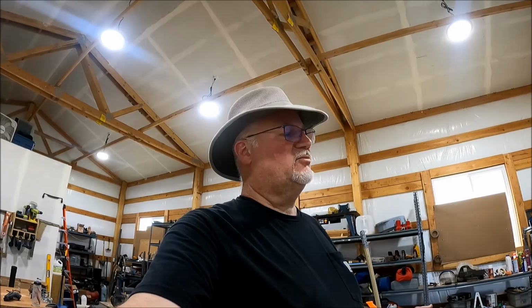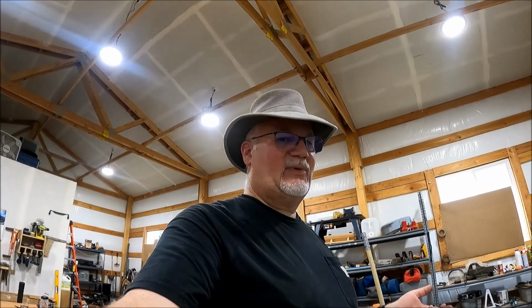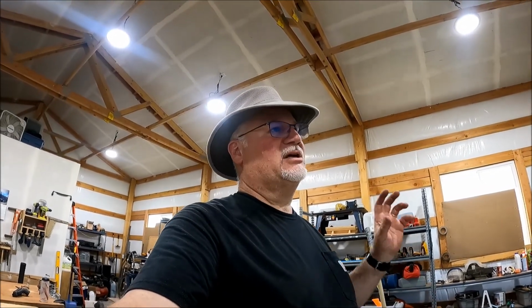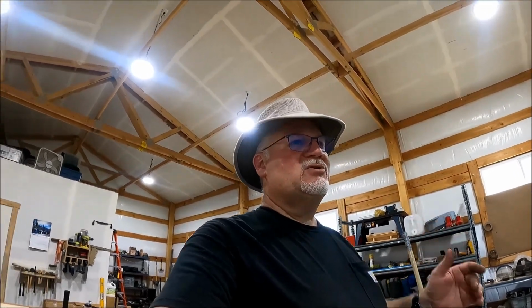I like to get set up the night before. Then you get rolling, you roll all day long, cleaning the mill as you go. I like to use the air to blow everything out and keep it running clean while I'm operating. As it gums up, spray everything out, get it out of the way. Usually that's a band change. One of the things I try to teach my customers is that when I go to do a band change, we get the site cleaned up. That could be in 2 hours, 4 hours, or 1 hour. All depends on the wood.